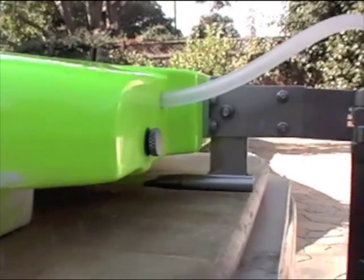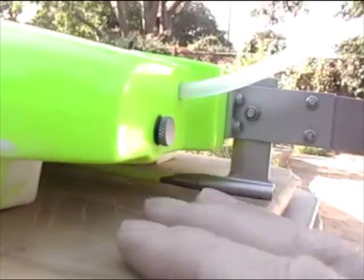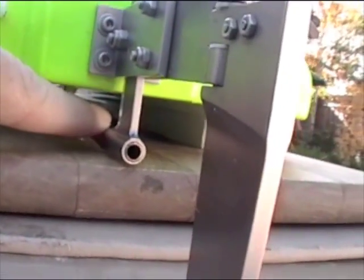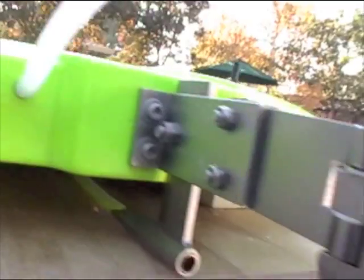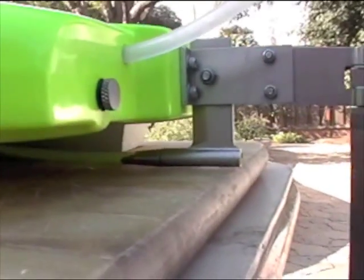First, you have to understand where you want to set up your strut on a catamaran. If you put the catamaran on a flat surface, you'll see that the sponsons are both sitting on the flat surface. And I like to adjust my strut so that it is just maybe 1/8 of an inch off of the bottom. I found that to be a really good position for this boat as well as for the Blackjack.